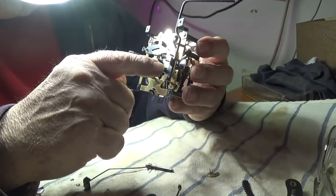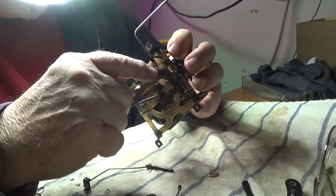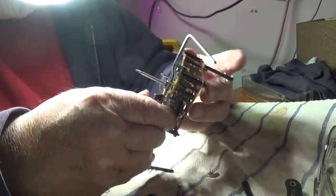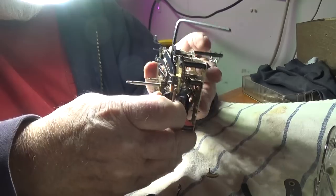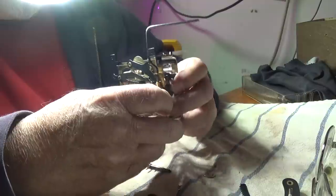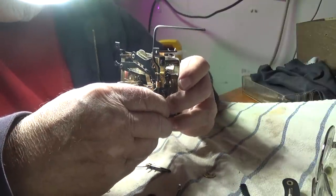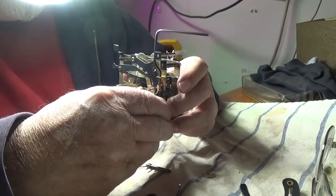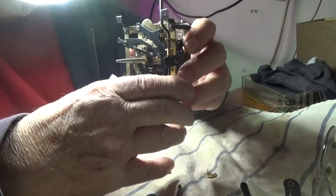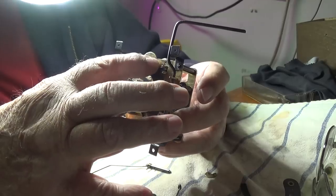That lever now is what stops the rack. And it's also got the tab on it. When this is in the up position, that warning wheel can run past it, and so it won't stop. Get the warning in place. When that drops back like so, now this will run. Now the pin is at the top. Okay,